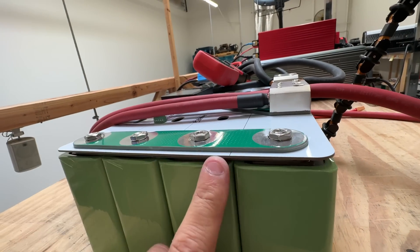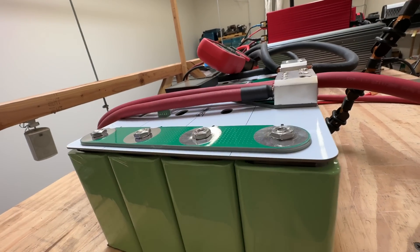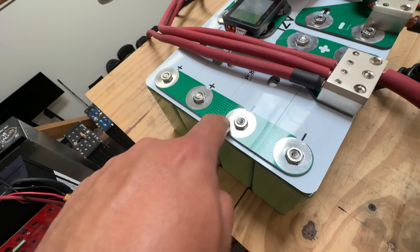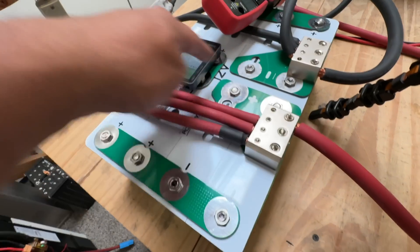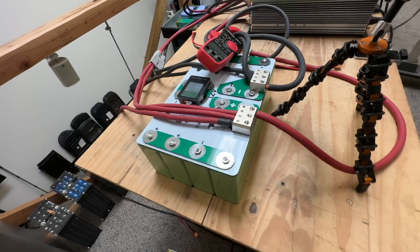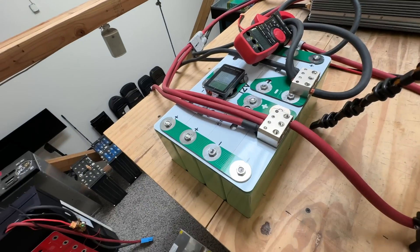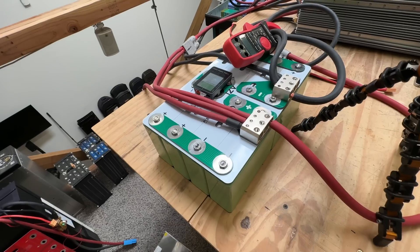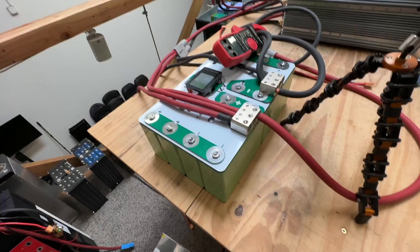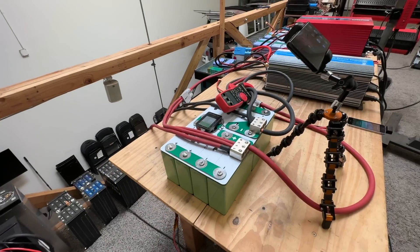I think these are 10 layers of one-ounce copper — 10 PCB layers — so that means 20 layers of copper in here. But the space is really small and really narrow, so I expect to see the heat here and underneath this one and that one over there. We're going to load it up with somewhere around 700-800 amps and see how those behave — if they remain below 160 degrees Fahrenheit, we'll find more loads and push it harder. For right now, let's see how it does at 800 amps.